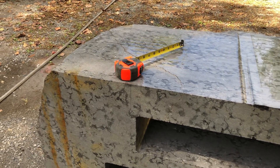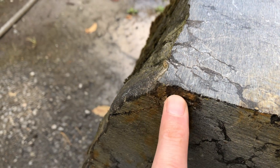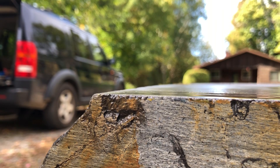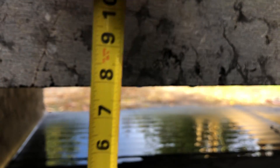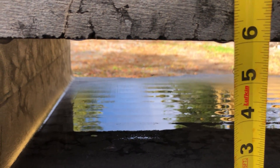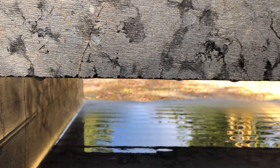I just rinsed this off and we'll take a look at a cut here. Here's the start of the cut where I took the top off — it's looking pretty good. I don't really see any waviness or anything. That's pretty nice. I'll give you an idea of how straight that is — it's pretty good. In CAD I drew these as six inches in height, and that's pretty much dead on six inches, at least at tape measure accuracy.